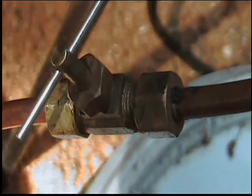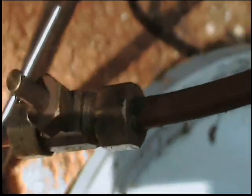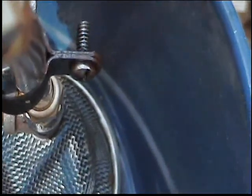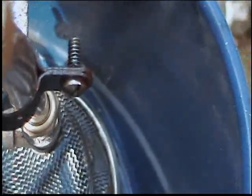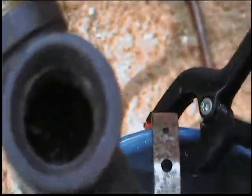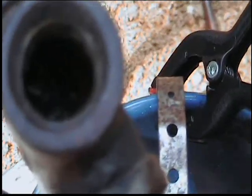What I'm saying is I could use propane to run the airlift pump, which I'm sure would work, although there'll be some propane gas escaping from the oil — which is far enough from the fire that it wouldn't light, but it's a waste of propane. In a pinch I really believe we could start the airlift pump with propane as well as the ball. If anything happens we can shut it off quickly — if for some reason the air bubbles coming out of the top of the tee were lit with a propane torch, it would put a burst of fire up here, but you don't need much so it wouldn't be much.